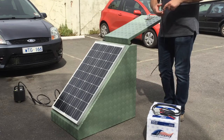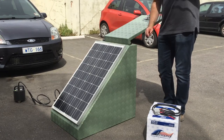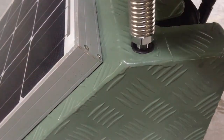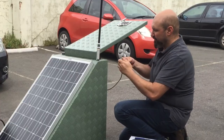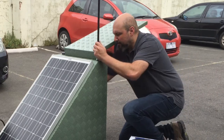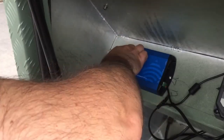This hut is fitted with a 3G modem, so we're going to connect an aerial. Take the screw and washer off the aerial that's supplied and feed the connector through the little rubber grommet in the top of the hut. Then push the aerial through, feed the washer and nut back onto the aerial cable, and secure the aerial to the hut from inside. Then take the aerial connector and screw it into the modem.